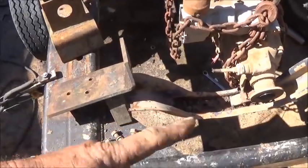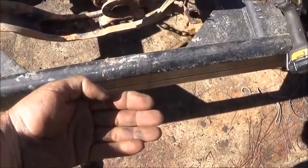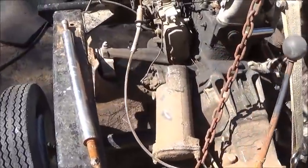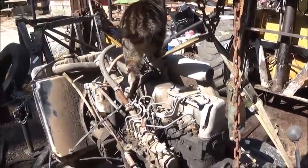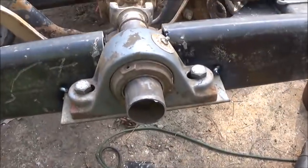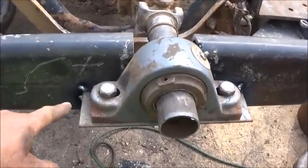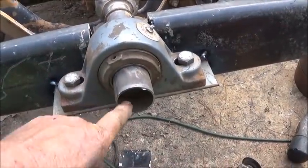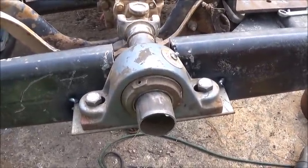We'll cut the pieces off these brackets and get them welded in, going up to the crossmember — stub it off straight and weld it in. That'll make a couple of good mounts. Then we've got to cut out a little area here for the shaft and weld a plate on the back to hold our bearing once we get it where we want it. Then we can get our shaft turned down. Like I said, it's not going to take long at all — it's a pretty quick easy job. This is actually not a Mercedes, this is a Cad engine. We've got our cutout bearing tacked on; I think that's where I want it — if not I'll break it loose since they're just tacks.